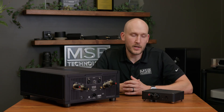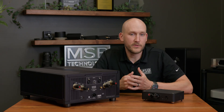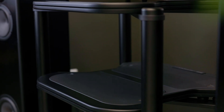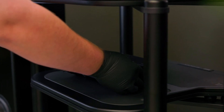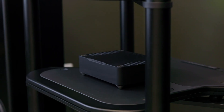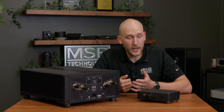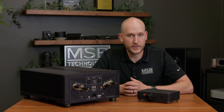If needed, adjustments to the gain can still be made on the ProSub Isolator if the powered subwoofer does not have enough adjustment available. The ProSub Isolator should be set up in an area with plenty of ventilation. Part of its design dissipates energy based on the efficiency of the system, and depending on the amplifier, this could generate quite a bit. Please make sure it is not in an enclosed space or covered when in use.